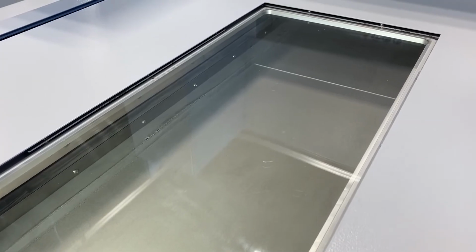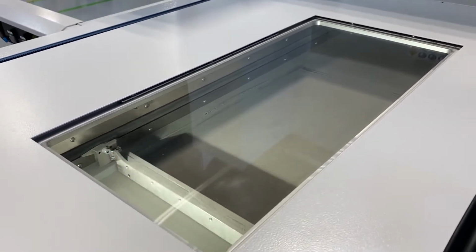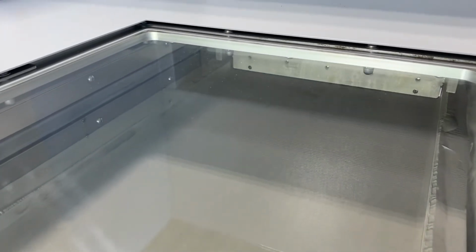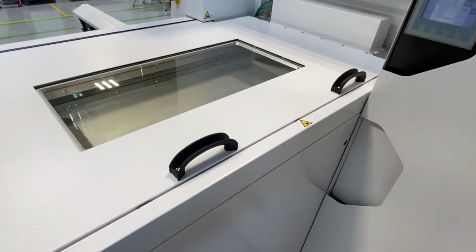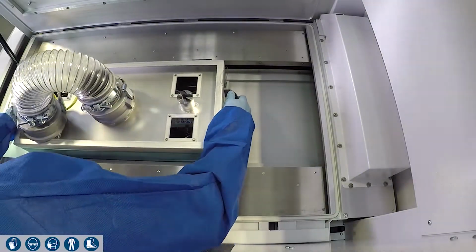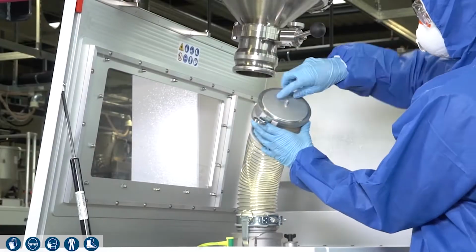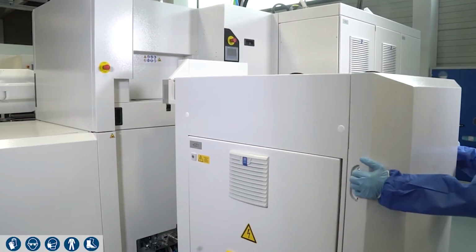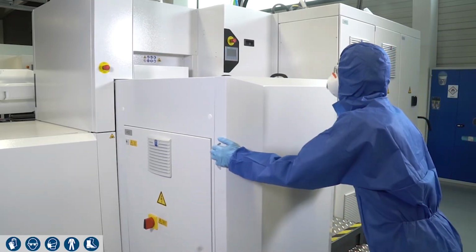The recoater pushes this powder into the process chamber, where it is picked up and distributed by the main recoater. The amount of powder is always sufficient for 2 layers, the forward movement and the return movement in the process chamber. To achieve a fast material change, a second dosing unit can be used, and only a few cleaning steps in the process chamber are needed. The powder is manually filled into the dosing unit before the build job. The flexible dispenser can be also filled at another location and then brought to the machine and docked on the rear of the machine.